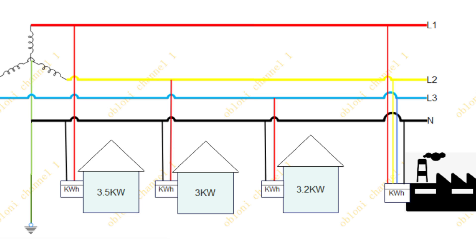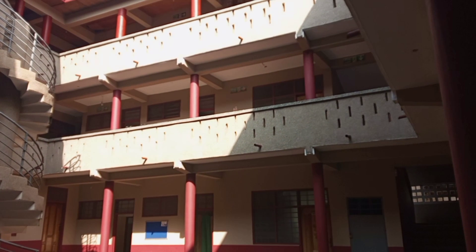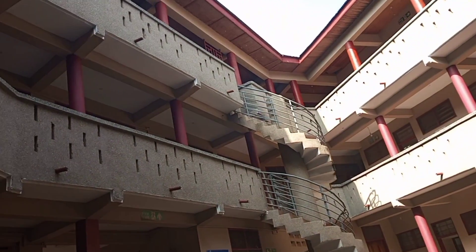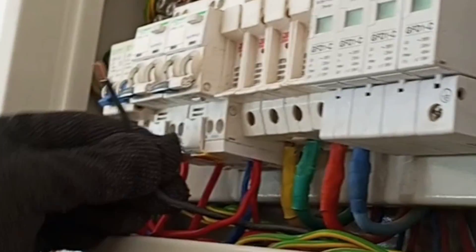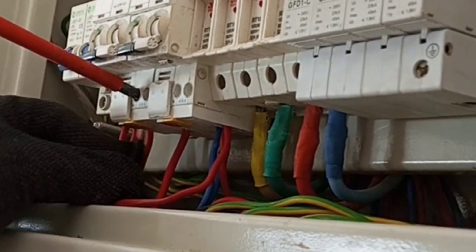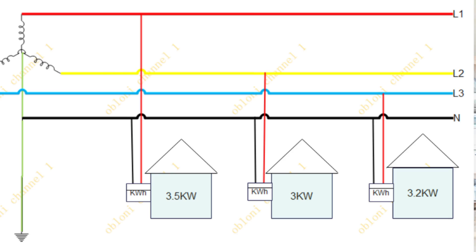It is this second point that brings us to our second main topic — how to properly balance loads in a three phase four wire system. This part of the video gives a general overview of how the three phase four wire distribution system works, and that will help you appreciate why it is very important to properly share load on the three phase lines. Balancing a three phase four wire system means connecting single phase loads over the three phases so that every one of the three phases carries approximately the same amount of load.